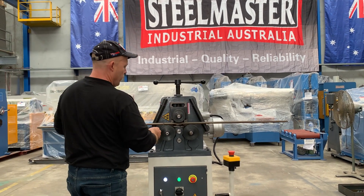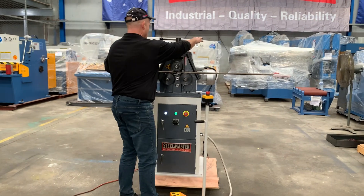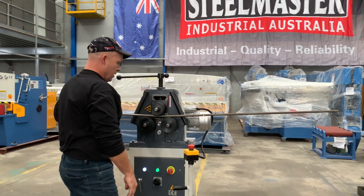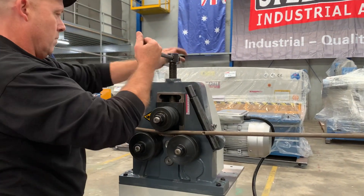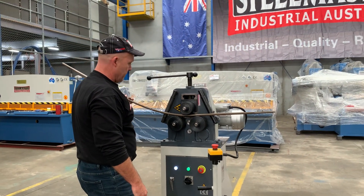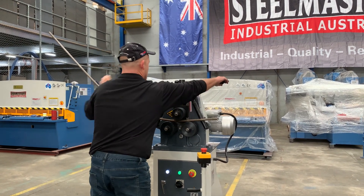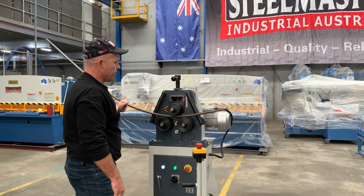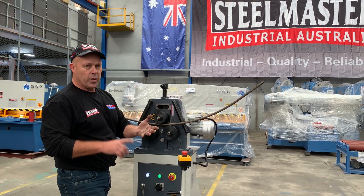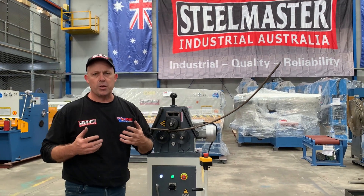So we've just got a little bit of rod there at the moment. I'm not going to do anything super special, but just show you how simply this machine works. Wind that down. And as we turn it — if you stand back, you can see it already sort of curving up and down. That just shows you the general concept of how a ring rolling machine works. By putting material in, whether it's round, flat, angle, box section, RHS, the whole lot — you can form any sort of shape you want. But you've got to get the configuration of tools to suit your profile.